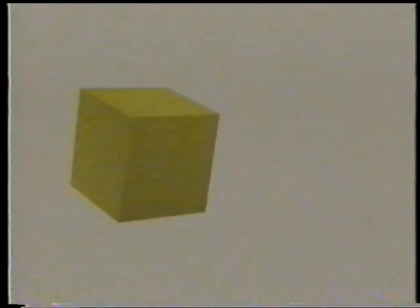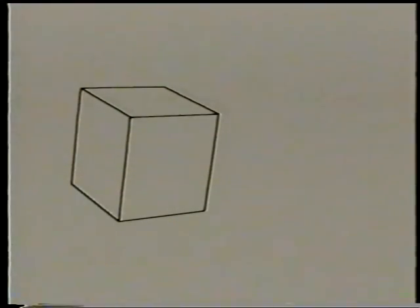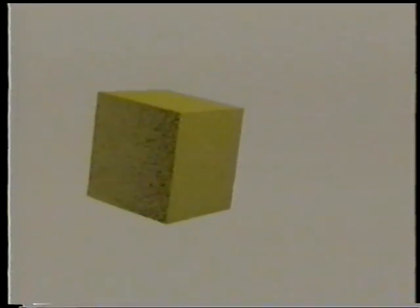If we convert this oblique cube to a line drawing, then you can see that no side is truly square. However, square to the viewing position, this face is truly square. Note that the front-back measurements are halved. This is known as the cabinet or cavalier method, depending on which manual you're using. When we talk about oblique, you can assume all the front to back dimensions are half their true value. But back to isometric drawing.